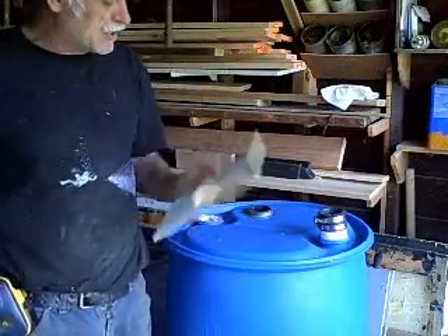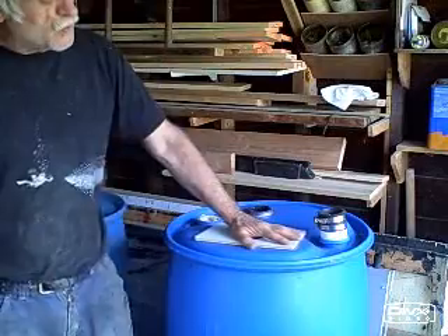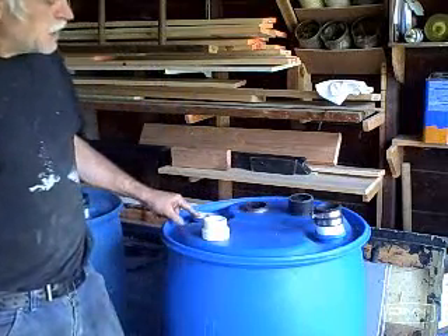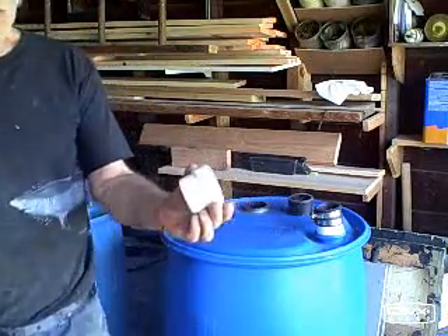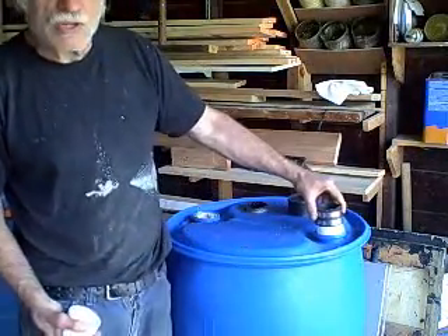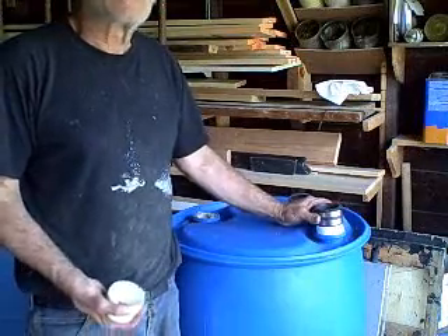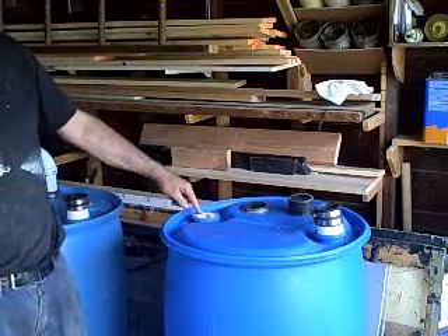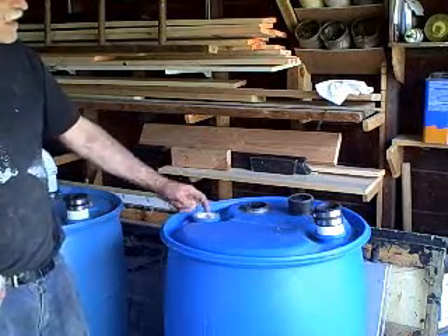You have a support shield like this before you drill to stabilize the hole — you just need to find some way of stabilizing it. Now we have two plugs in the 60-gallon tank, and one plug has pipe thread. So we can put this threaded male adapter right in here, and then connect some PVC and then a rubber boot to that. This other plug, unfortunately, does not have pipe thread, so we put some gutter cement on it and tightened it down to make it watertight.